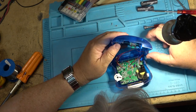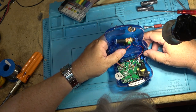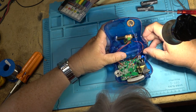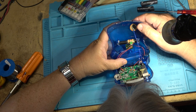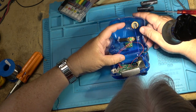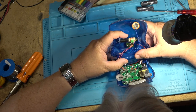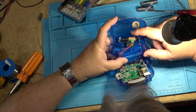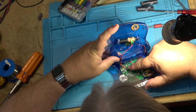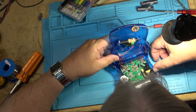I've never been into this before, but here's the inside workings. We have a little ceramic oscillator on the back here — or a crystal. No, it's not a crystal, it's a capacitor. I guess this is to make the antenna resonant at 60 kilohertz. We've got a couple of crystals down here on the board — there are two of them.